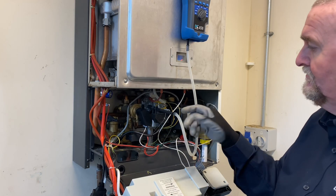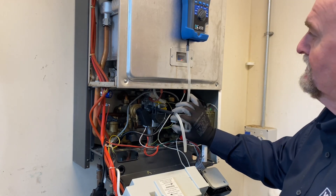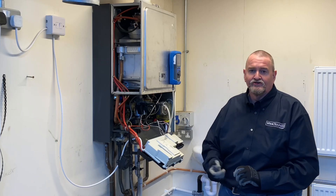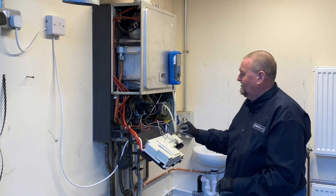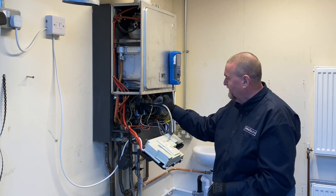I want to double check the low, so I'm removing the connection. Checking the low - because I held the minimum adjustment screw, the low is 2.3 millibar. That's fine, we've adjusted it. Now we pop the little dust cap back and we're going to double check the readings. We always do the final readings with the dust cover in place.